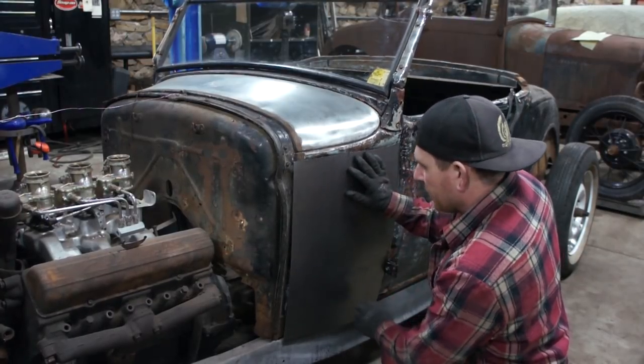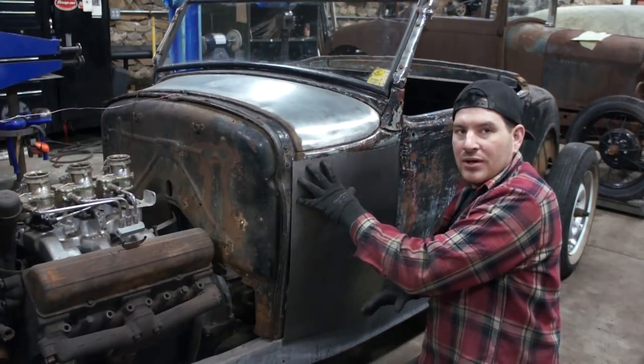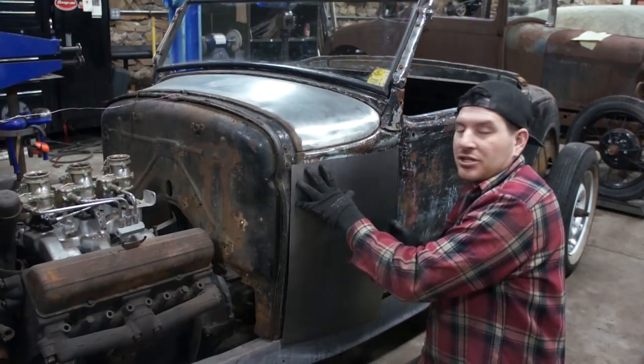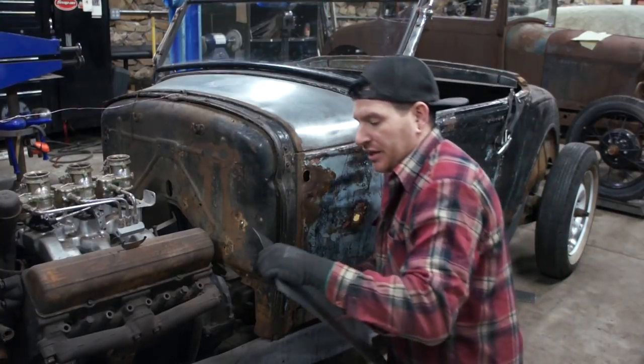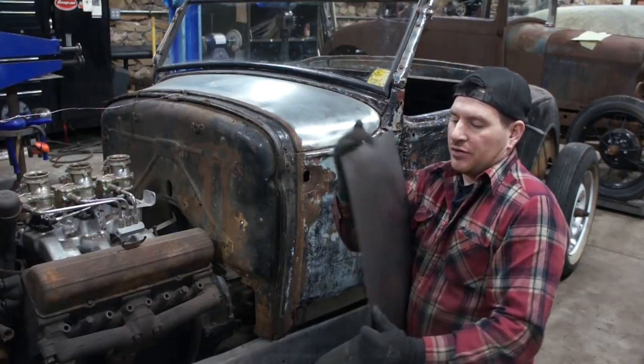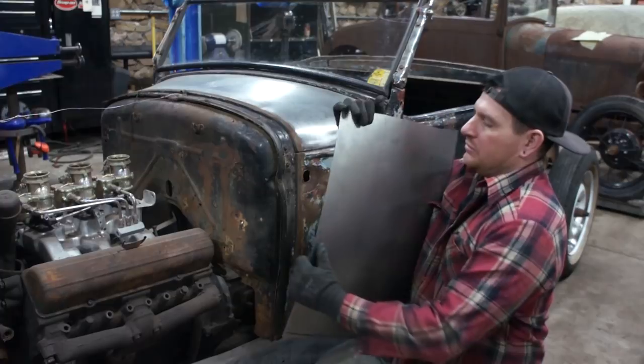And to hang it off at the bottom here, this doesn't mean that it needs more shape on the wheel, it just needs form. So form is where you're actually not changing the properties of the metal, you're just forming it into position. So all I'm going to do is give it a little twist with my leg